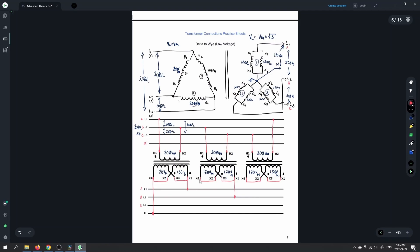It's a matter of how clean you want to make your diagram. This one is definitely coming down to the neutral. It's fine if you want to bring this X4 down to there — it's essentially where it's going, also tying into here. So it's up to you how you want to do your diagrams. This X4 is going down and feeding the neutral there, but it's also coming over here and tying in. So all the X4s are brought together and that's brought to the neutral. Out in the field, the neutral is bonded to ground.